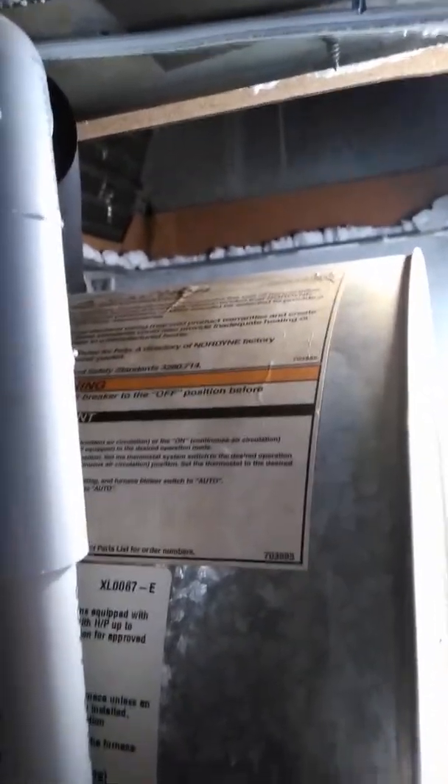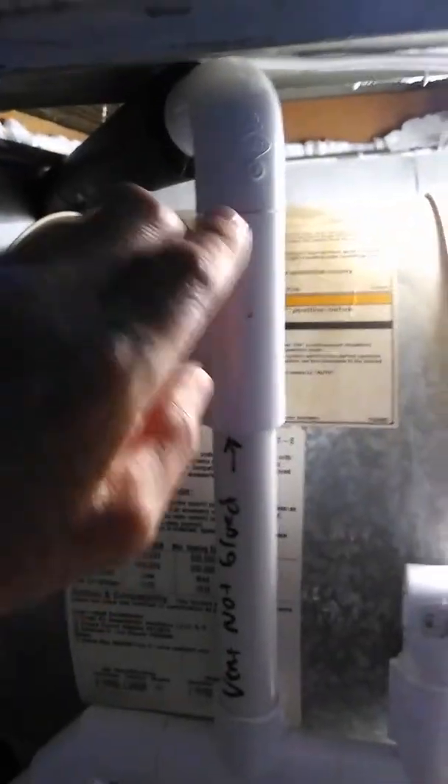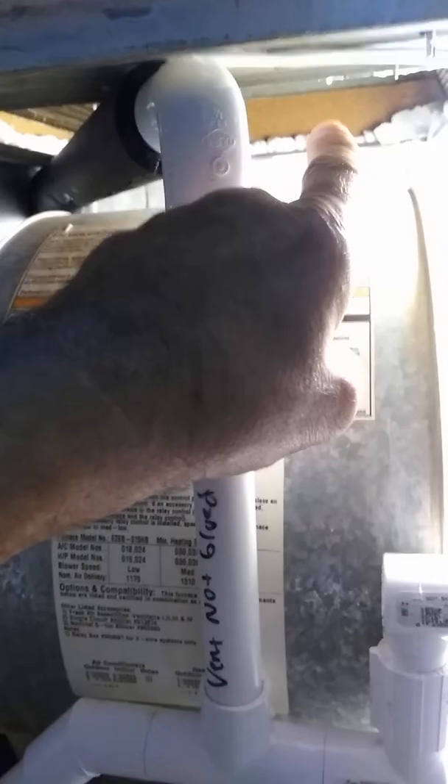So back to the issue at hand. If you look at the cork — video number four — I explained how I resolved the issue. I insulated the inside, just the inside of the pan, to keep it from condensating with a self-stick cork. And then to prevent air from infiltrating between the flashing and the pan, I used expanding foam.